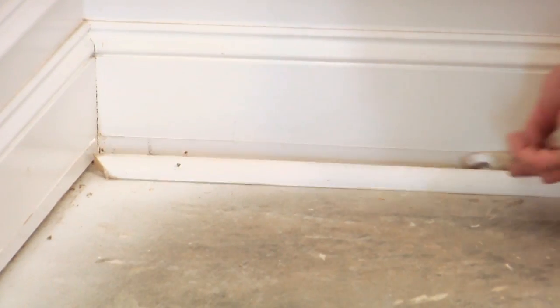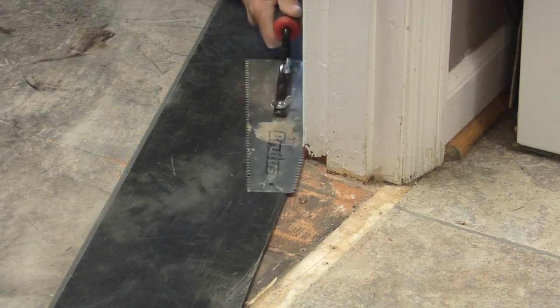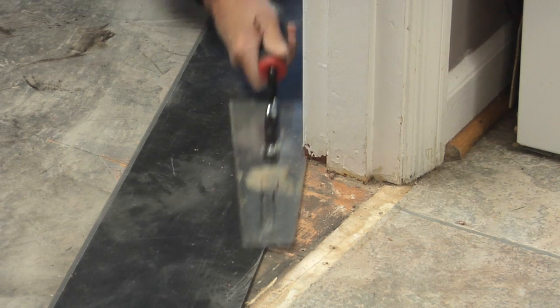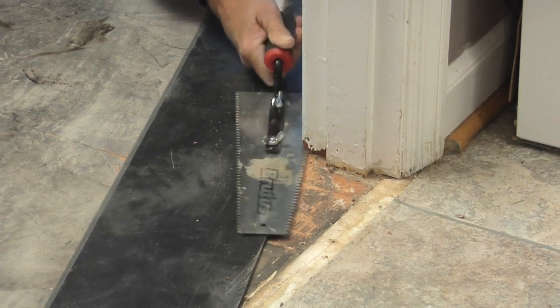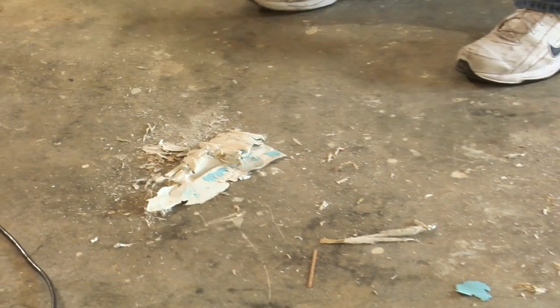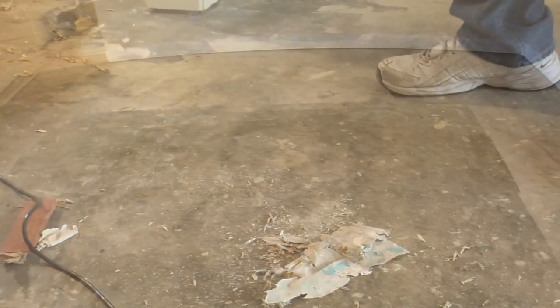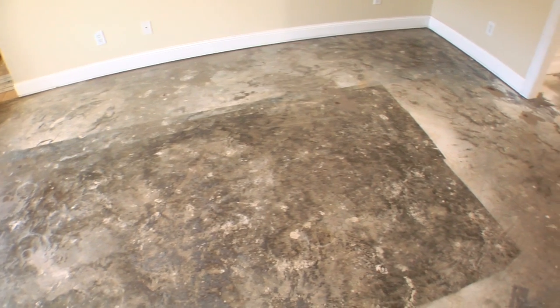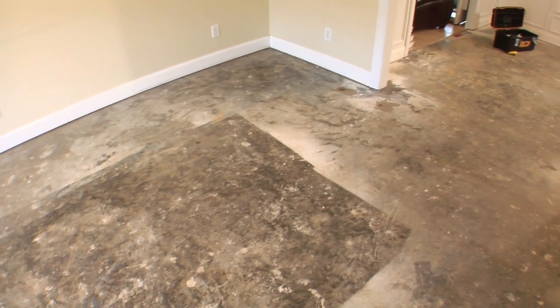Removal of wall baseboards is optional as quarter round can be installed to avoid baseboard removal. Undercut door jambs so the quarter-inch expansion space is maintained, allowing the LVT to slip under door jamb or case molding. Sweep the subfloor clean and ensure it is free of all contaminants. Once your subfloor is smooth and clear, you're ready to begin installing your LVT.